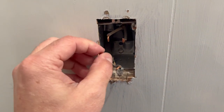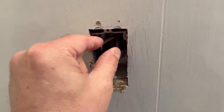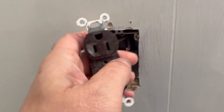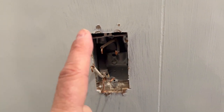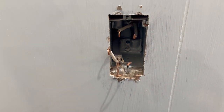Today we're working on the receptacles. I want to show you a good example of what not to do when you're doing your receptacles. This much wire sticking out is not a good idea — there's not even enough to get anything in here. I literally had to turn the receptacle and force it sideways, take the screws out just to get it out. We're going to end up pigtailing this. But don't do this — if you're going to do a receptacle, leave enough room in there.